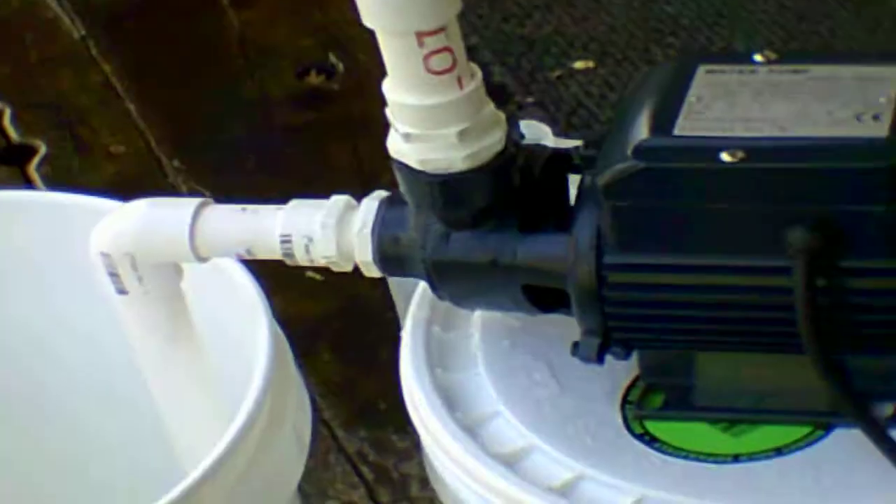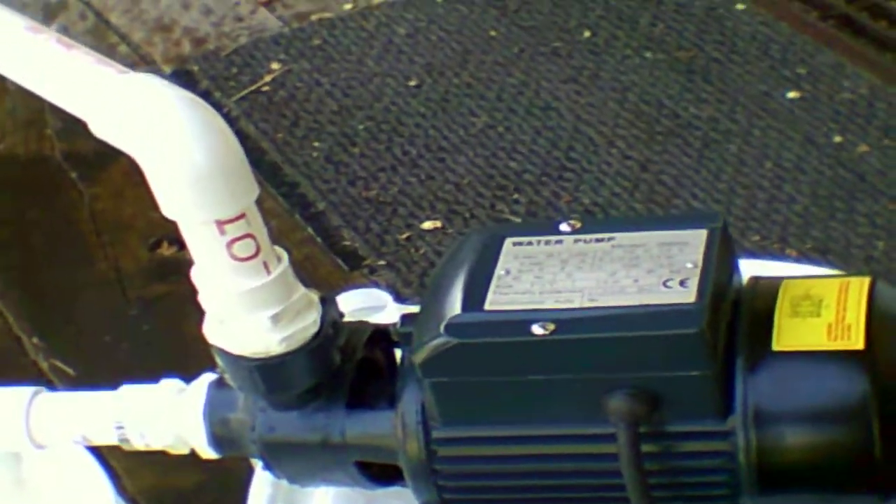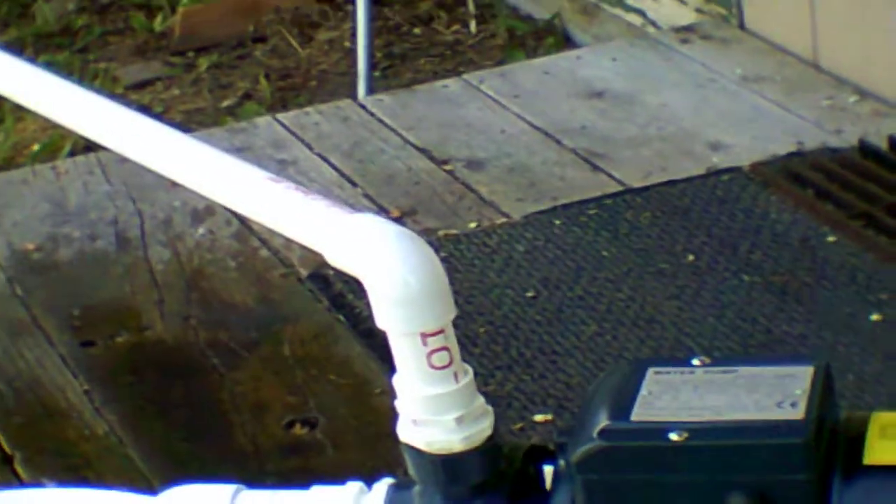If you're wanting to use one of these off-grid, I'm going to shut this off before it gets down to the bottom of that foot valve — I don't want to suck air up. If you're going to be using one of these off-grid, do not skimp on the inverter. I already tested the 400 watt inverter, which should technically carry this because it is a 350 watt pull, but it kept overloading and tripping — and it is a cheap Walmart inverter. A 1000 watt inverter would pull this, possibly a 750 watt inverter — most likely that would do it. And my 1100 watt inverter handles this with no issues. And you can see how well the water flow is.